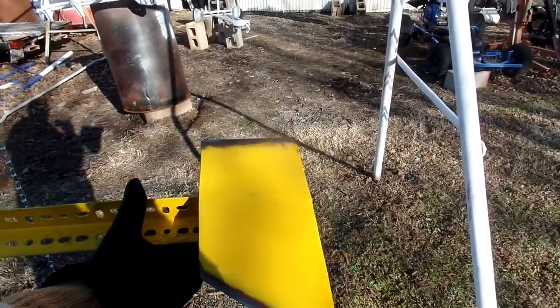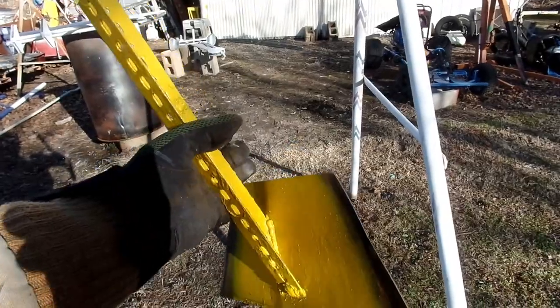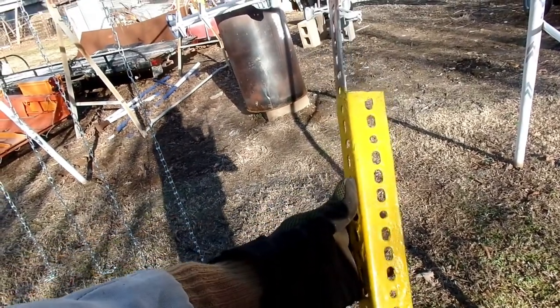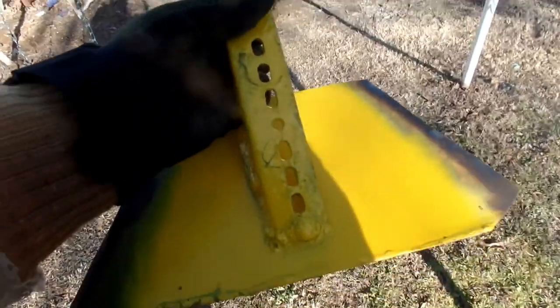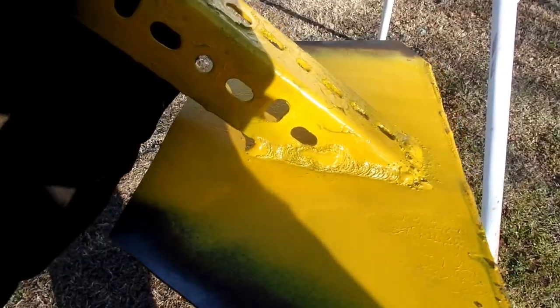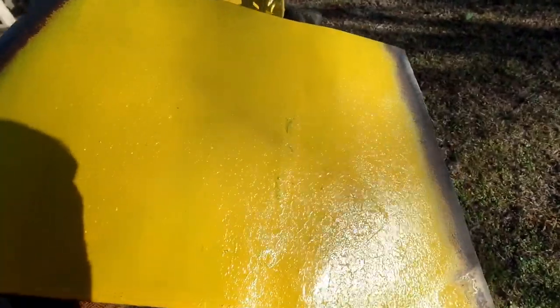I've got the sun to my back so I'm not getting blinded. This is going to fit like this. I got my sheet — this is 14 gauge — and it's the stuff they put garage doors up with. You can hang plumbing and all sorts of stuff with it and just cut it with your band saw. I took care of a spot that was cut right there. I had blow-through, which is why I've got those big knobs — it's also called gap welding. When you're out in the country you know what gap welding is. I had to fill in those holes and make sure it stuck really well. On the back you can see a little deformation, but that's penetration showing it got really good penetration.